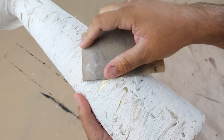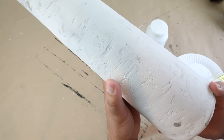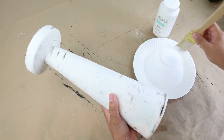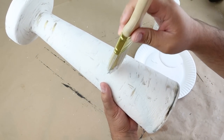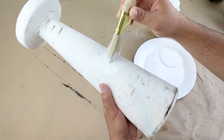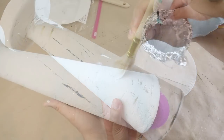Once we have the compound all over it, I'm going to sand it down. I want a much smoother texture than when it was first applied, so I'll smooth it down with sandpaper. Then we're going to use white chalk paint over all of this. Instead of brushing it on, I'm just going to dab it all the way around — I'm trying to avoid any brush strokes. I want this to look like poured concrete instead of painted on, so I'm dabbing all the paint on.